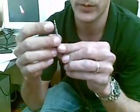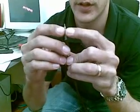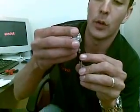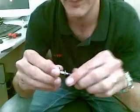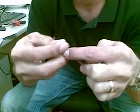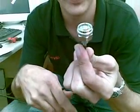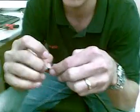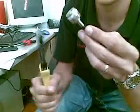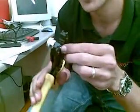Put your sheath over the whole thing and pull your wire mesh back. Take your N-Type connector, push over it, and push in until you feel a click, like so. Then push your wire mesh over and your sheath goes over that. Crimp with your LMR195 crimper.